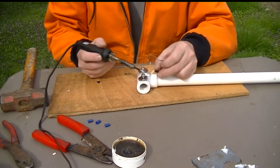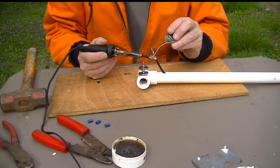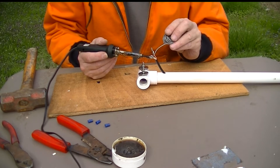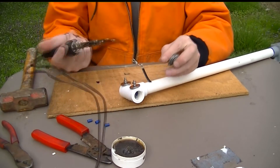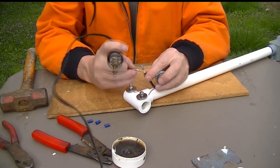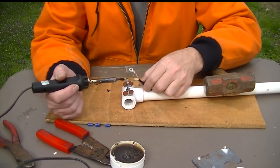We put solder gunk on the tip, put it in the flux, and it brightens right up — see that? That's the importance of the flux. A little bit of solder on the iron helps with the heat transfer. The rosin's boiling — get this on there rather quickly so that you don't destroy the insulation. The solder is starting to melt and we have a joint like the others. I'm going to run it around the tip of the ring just to give a good electrical connection when we crank that split washer down into it.